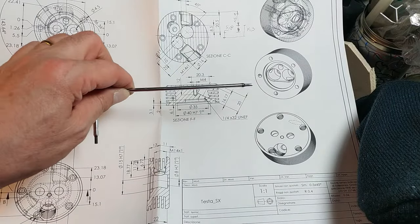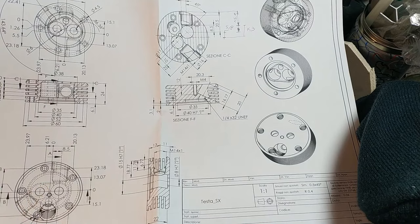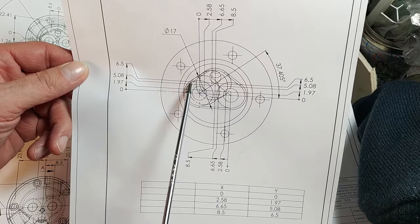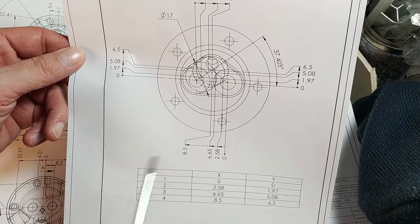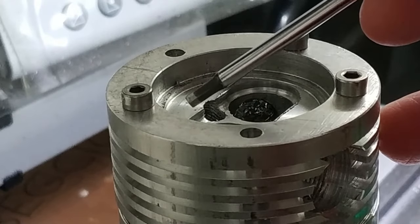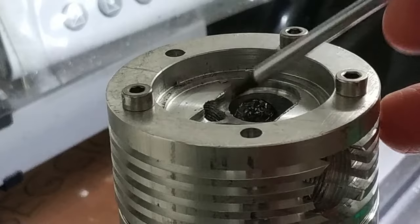What I will try to do with my boring head is make this round corner — one and one. This part is not a problem, but this one, I think, will be a problem. So I make some reference points from here to here. You can see the movement of the boring head covers 70 millimeters. I will try to make a line here and a line here, moving with the X and Y axes. The depth is three millimeters from this plane to this plane, and now with X and Y we will try to make this corner round, moving in X and Y. I hope we'll find a good solution and good results.